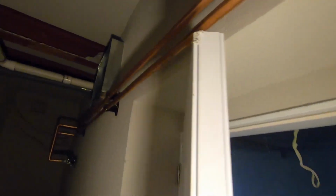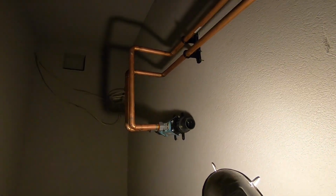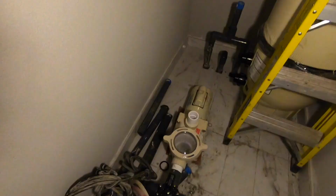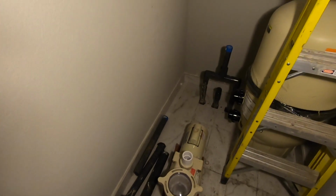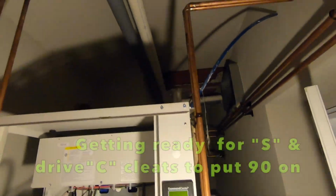Pool auxiliary comes up. Rod along all the way here. And the pool guy is going to hook up to this on opposite ends, supply and return. He also has two lines coming from here, pool water to the unit. It goes to the coaxial condenser. Here and here, I'll probably start it off for him and we'll meet halfway.